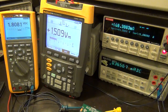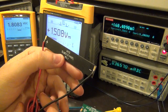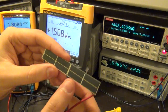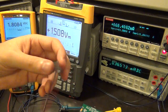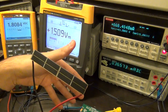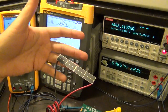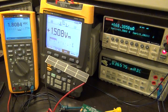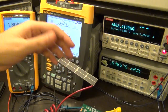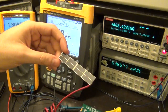What I wanted to do is try it out with an actual solar panel. I bought this SLMD121H08 solar panel. It's very small and narrow - the kind you might use for a calculator. I believe it's about 23% efficient. Its open circuit voltage is 5 volts, which is just the maximum the IC can accept, and its short circuit current is 50 milliamps. This is perfect for this application because its voltage will never go above 5 volts to damage the IC, and it's most efficient at around 1.5 to 2 volts.